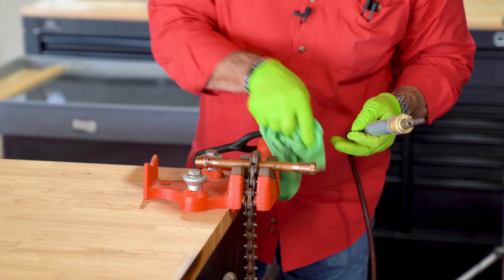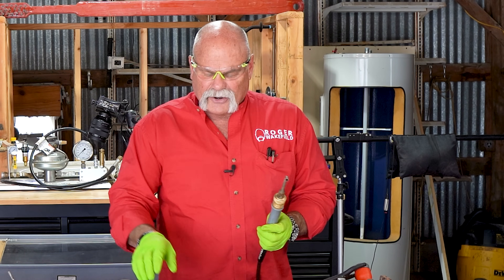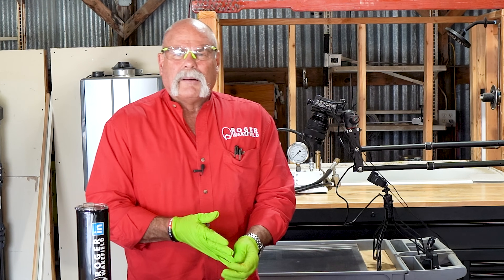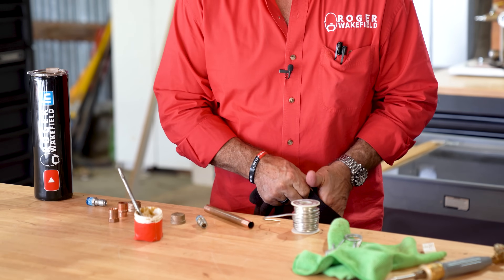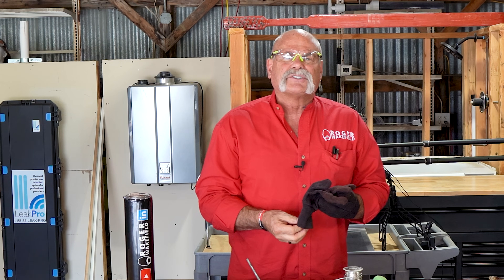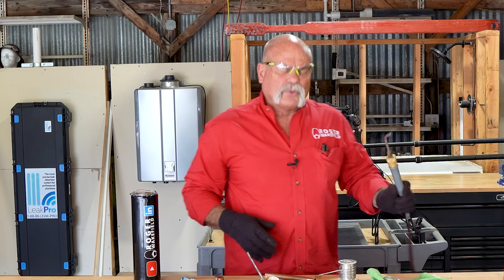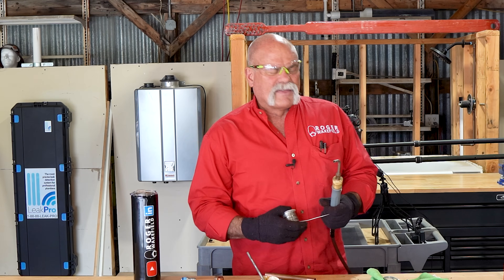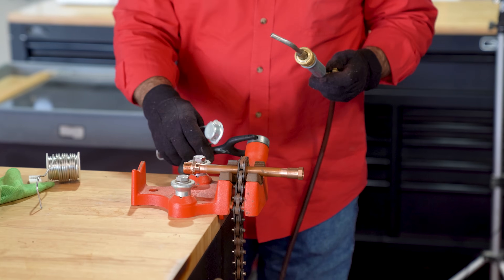I do like wiping them off just a little bit before I start. Now remember, soldering: the metal heats up, it stays under 850 degrees. If you're already working on plumbing and soldering, tell me what torch you use — do you use a Prestolite, a turbo torch, or map gas? Turbo torch is probably one of my favorites because of the versatility — just change the tip. This will give you a little more heat so you can work in different areas. Let's go ahead and get this thing soldered.